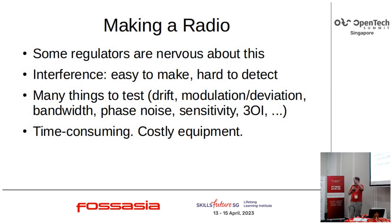Now, this was a 2 meter VHF, so the 70 centimeter harmonic was in an amateur band, but it's an amateur secondary band where listen before talk rules apply. And of course, if you don't know you're transmitting on the band, you can't listen. So he was, in fact, breaking the rule, albeit unintentionally. So a very large part of the risk is that you're doing harm that you don't know you're doing. And so it's that problem that I'm looking to help simplify. It's not the whole issue, but that's certainly the biggest one. And from the standpoint of regulatory risk management, that's really the issue where I'm hoping to offer some comfort.